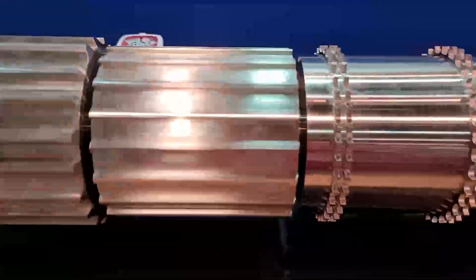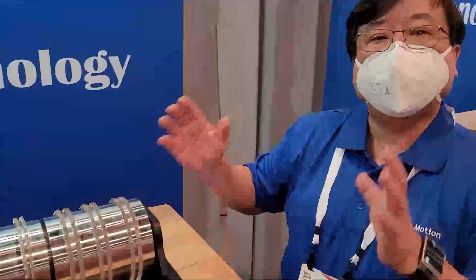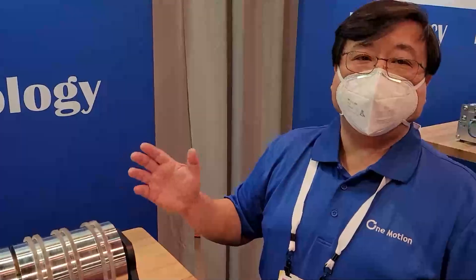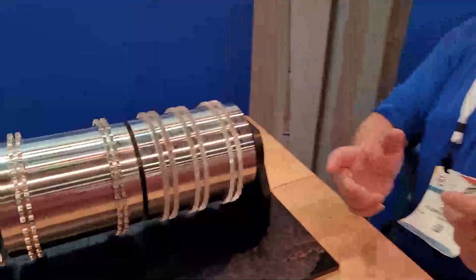All of these builds can be used for four-to-one merges, four-to-two merges. You just can't have the space savings with a servo motor or gearbox, or an AC motor and gearbox — you can't nestle four of those mechanisms underneath your conveyor to do the same functionality.